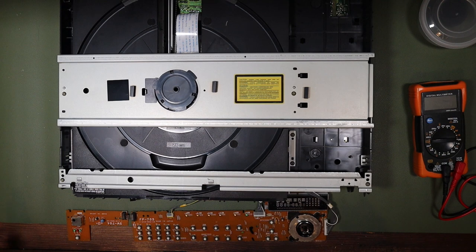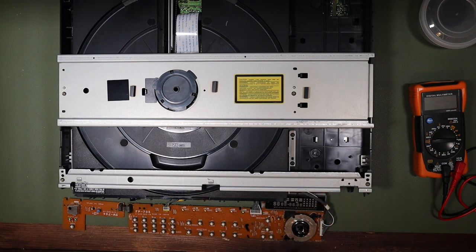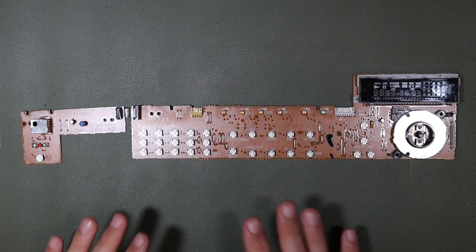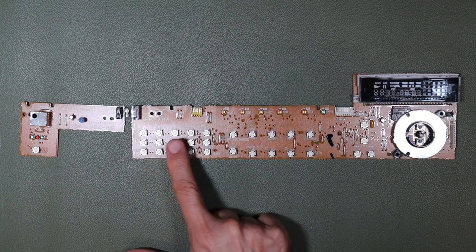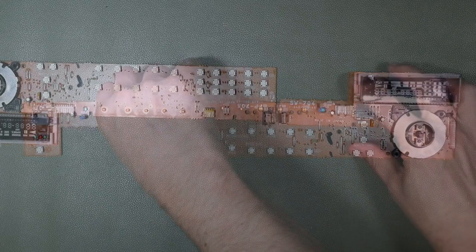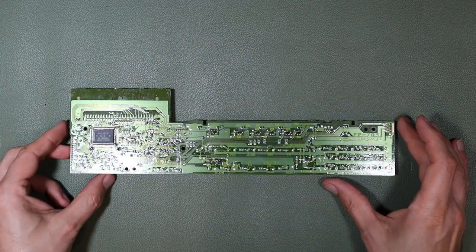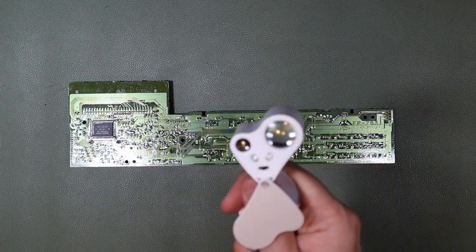It's the next day now, and I finally have this board free of all the mechanical strain relief things and cable management. I'm going to remove the connectors, take a good visual look at the board, and exercise these connectors in case they've had some oxidisation over time. Here is our display board — it looks like it may be two boards. This is presumably the infrared receiver, and over here all of the buttons, a rotary control, three connectors, and the VFD display. I'm going to go over it with a magnifier and come back if I find anything.